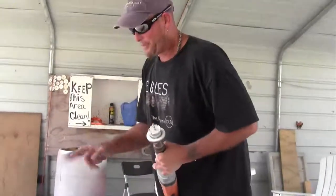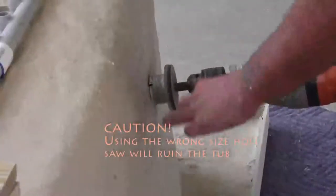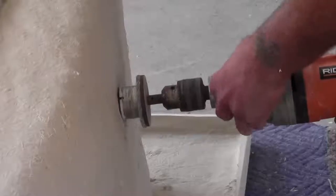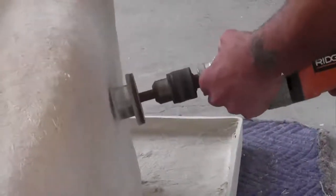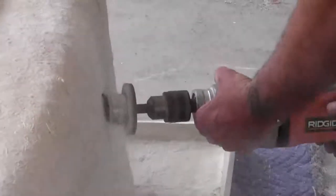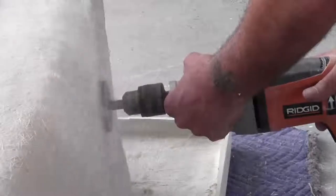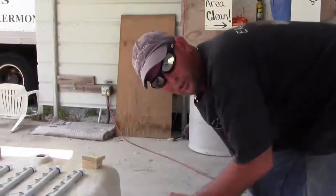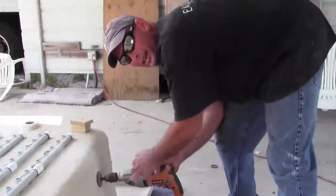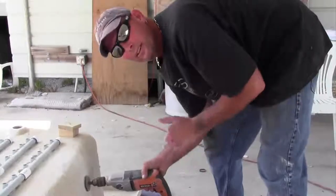Starting with the standard bit, I'm going to drill all the standard holes. Make sure when you put your bottom hole in there, you have the right hole location that you're drilling — don't over-drill the wrong hole. Carefully start it out. Once your hole is drilled, make sure you line the drill evenly with the wall so that it sands evenly, not offset, because your jets will not fit properly and you will wind up cracking your jets and ruining them.